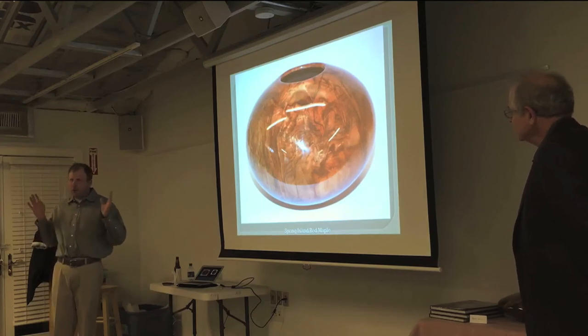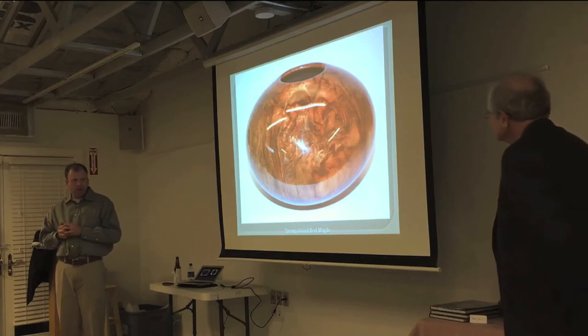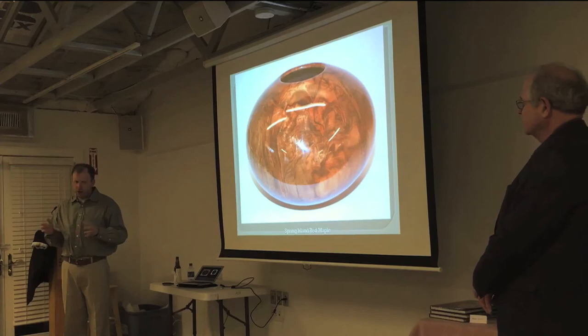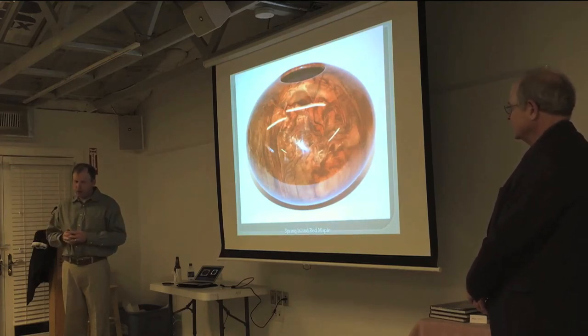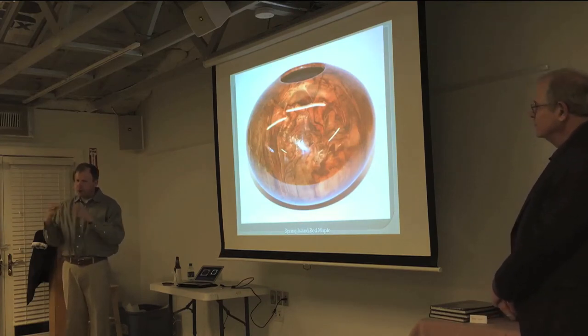Anyone familiar or heard of the term spalting? Tell them about spalting. Okay. So spalting is decay in wood. When a tree dies, hackberries, maples, oaks, they can be healthy and they have clean wood with no color. As the decomposition begins, the fault lines, in a sense, can turn black and discolor, but the structure of the wood's still there. And the best way I like to describe that is we try to capture that moment.